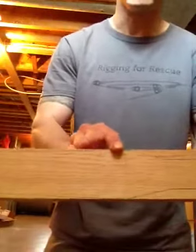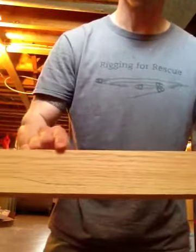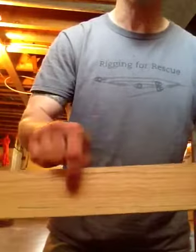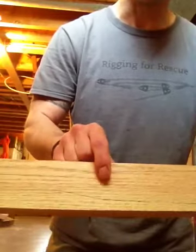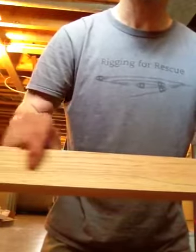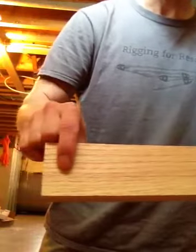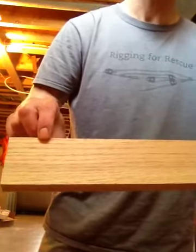Followed by your bending limb, which goes from the end of this fade to the beginning of another fade here. And this whole length of 15 inches will bend, and it's the working part of the bow. Once you get to the fade here again, you've got a 2-inch fade that doesn't bend into a 9.5-inch stiff limb portion. And that'll be your tips.